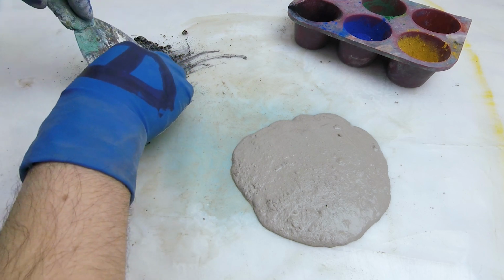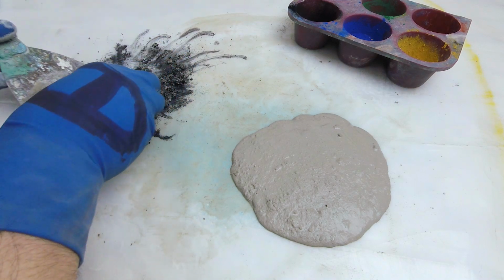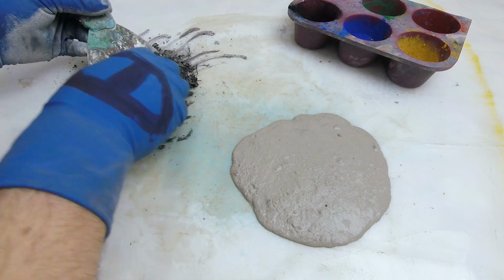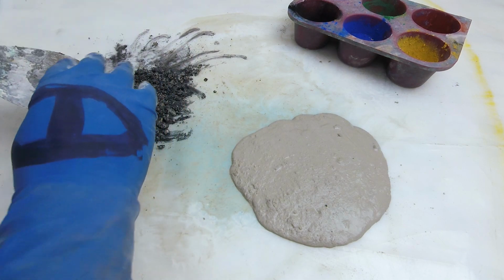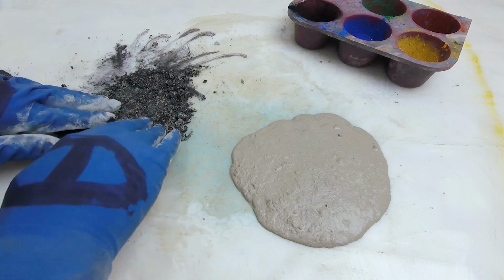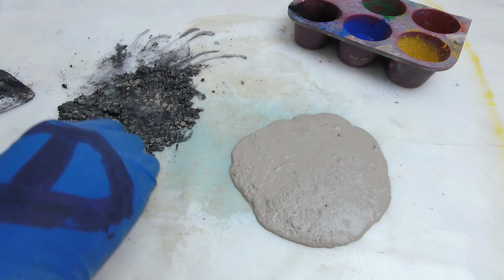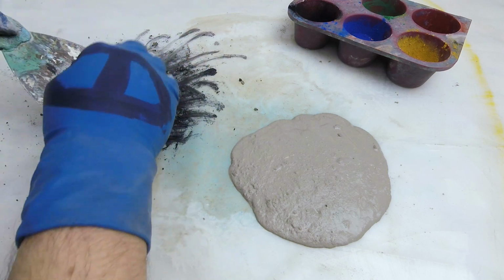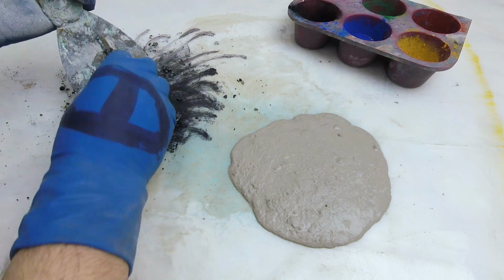That's one of the interesting things about pigments and being an expert in color, is that if we order a ton of pigment, or 500 pounds, well, yeah, we can sometimes order up to a ton, we're so comfortable working in mineral pigments that we can make adjustments. So if a blue is not looking like it has the right amount of red content, or it needs to be darker or whatever, we can use our pigments and adjust. As much as we use blended colors, we do lots of color blending for you too. So if you want a color of concrete, just ask.